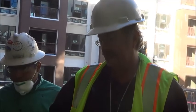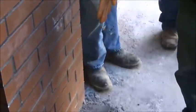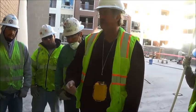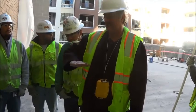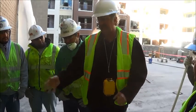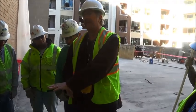250 GC. Let's say the 250 GC is coming out here, and the plastic board is only coming out 6 inches. The way to protect 250 GC is to take a 3 to 10 mil poly sheet, something that's meltable with a torch, because the 250 will not melt with heat. It just won't. Torch that poly off ever so slightly, and then you can take your epoxy and put it on the 250 GC. The epoxy will stick to 250. You run it down over from the 250 onto the concrete about 2 inches. You completely cover it, throw silica sand in there, come back the next day, and you can prime it, you can do whatever you want, and then the hot rubber goes right on top of it.